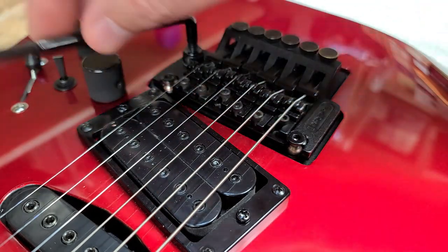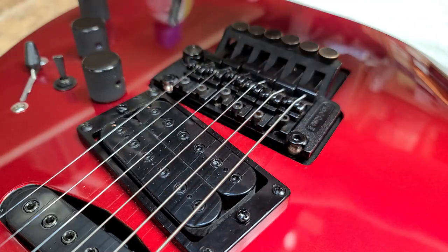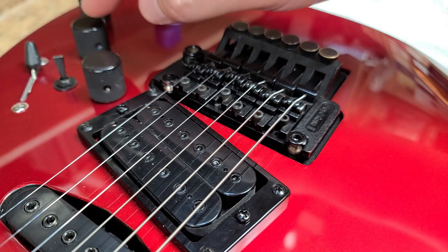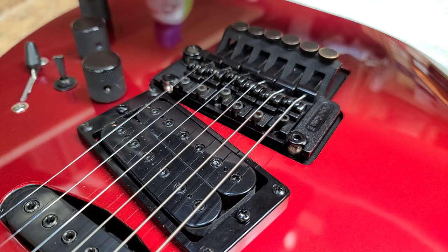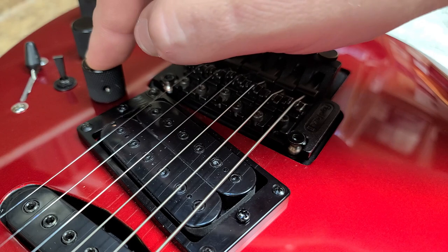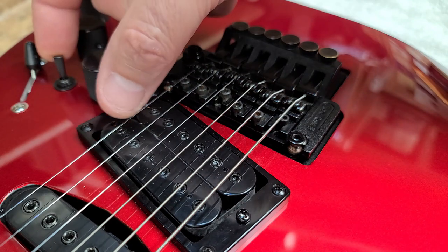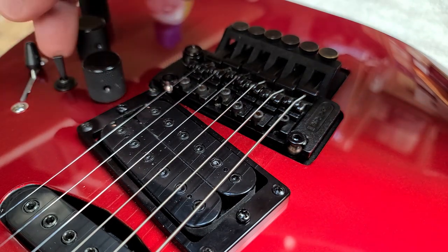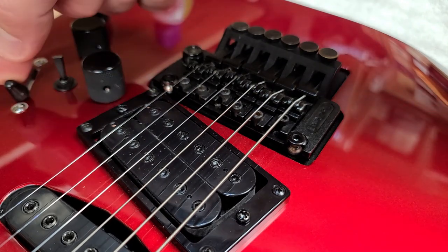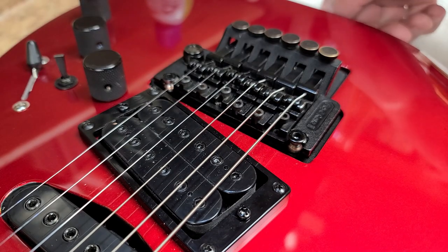This thing is stock as far as the wiring goes — there is no fancy wiring whatsoever. However the original guitar was: you got your volume, tone, tone — neck tone and center tone. There is no tone on the bridge. The only thing on the volume control is a treble bleed. This switch basically throws the pickup out of phase. When it's in humbucker position and you flip it forward, it acts as a guitar kill. The five-way switch works basically like a five-way switch. Let me flip this thing upside down.